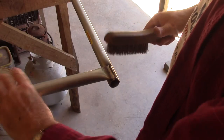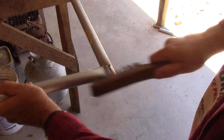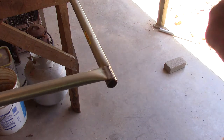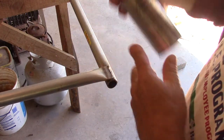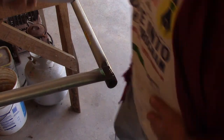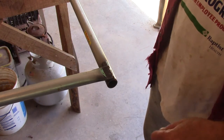While it's still warm from welding, take your wire brush and knock any loose material off of there. Then give it a shot of this cold galvanizing compound — it's not as good as real galvanizing, but it'll help hold down on the rust.